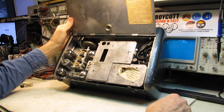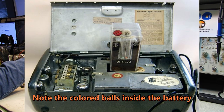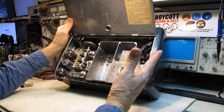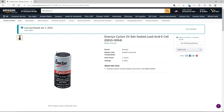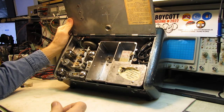So I'm probably going to have a few dead tubes. The battery went in here — it had a built-in hydrometer to tell you the state of charge, and it directly plugged onto these two terminals. The whole battery just slid in there; it was a flooded lead-acid battery. And of course it's no longer available — it's a 25-amp-hour battery. Now I did find these batteries; I've got an 8-amp-hour battery coming. This same company makes a 25-amp-hour battery, but it's about an eighth of an inch too tall and about a sixteenth of an inch too wide to fit in here, and it doesn't have these back terminals.